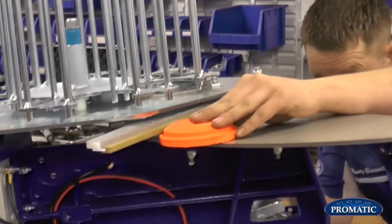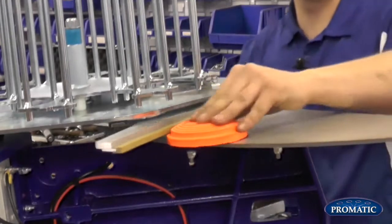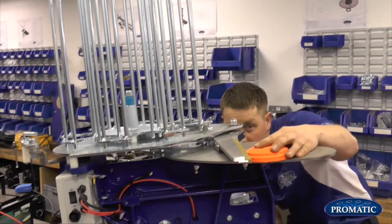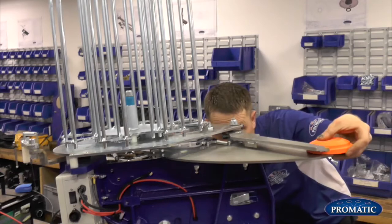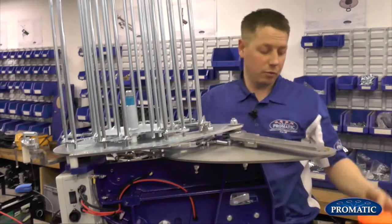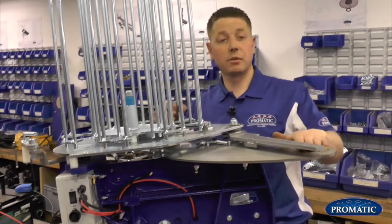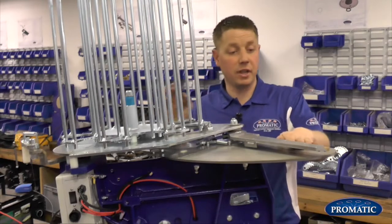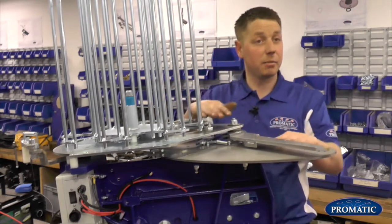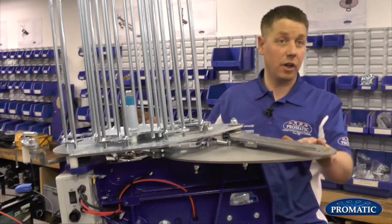As we bring that round there now, we'll see that we've got a nice gap there of a couple of millimetres. As we bring him round there, again, the same. And then towards the end, it's the same again. Because regardless, if it's too tight, so the actual clay is pinching on the casting plate, that will cause no birds. The other one is if it's set too high, so the casting plate is too low or the arm's been bent, you lose distance on your targets.